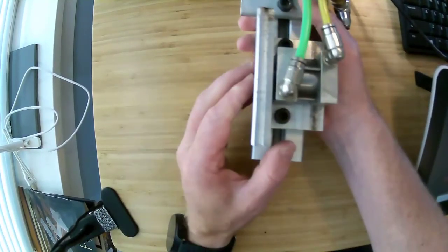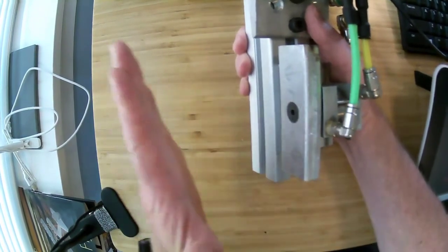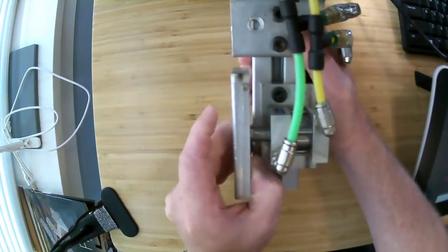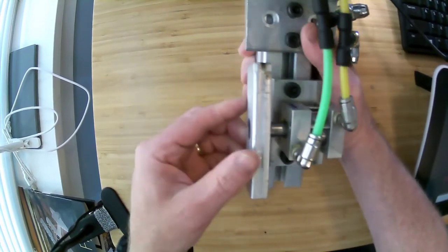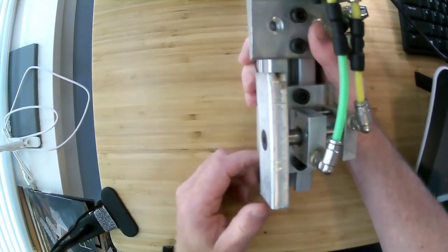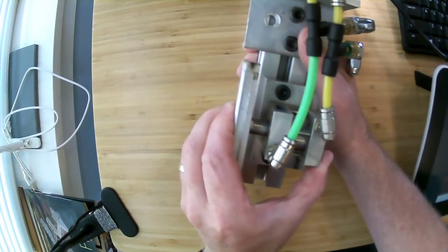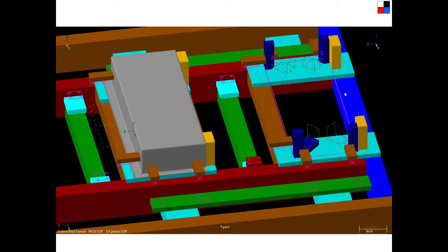Wanted to show you one other style of heat sink that he uses. So this is a heat sink that he made that just goes against a large surface, just trying to draw out as much heat as it can, also doing some work in clamping things in place. And so this one's made out of aluminum, so that means it will cost about 1/4 of the brass one, and it also cannot absorb as much energy before it heats up. Okay, so looking back at the drawing for a minute, that's really a lot of what is in this fixture.